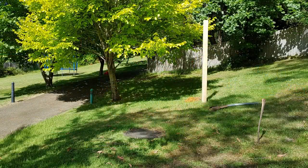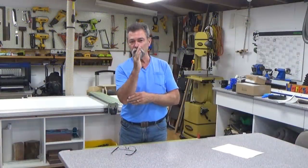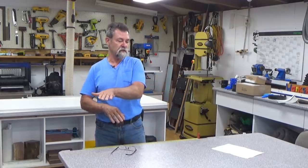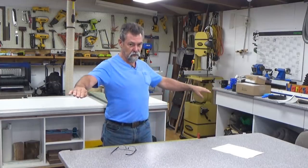I dropped the post in, and the good thing about the narrow hole was it stopped the post rocking all over the place — it nearly stood up perfectly on its own. I got one of the rafter sections and used that as a beam to assist in getting a level point. Even though there is a slope downhill, the swing set is positioned perfectly level across the hill.